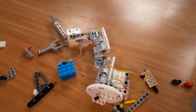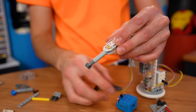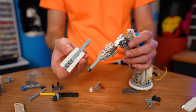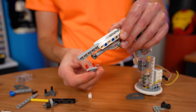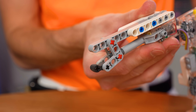This is the robot arm design I have. We have a motor on the front that we need to connect a gripper to — that should be pretty simple. Since we have a motor at the front, I'm going to attach a little actuator so when we turn it on, it will open and close. I put in a few pins and connected some bars on top so we have two bars, then a linkage mechanism so when we move the bottom bar, it closes and opens the claw — just like that.